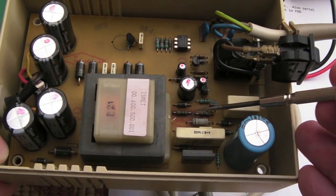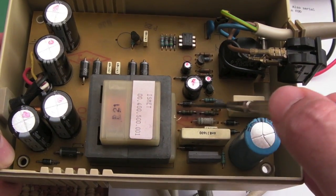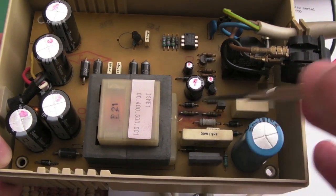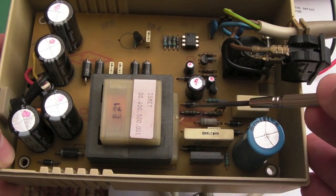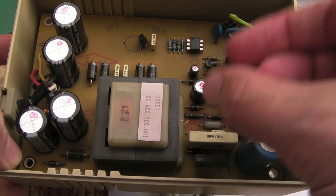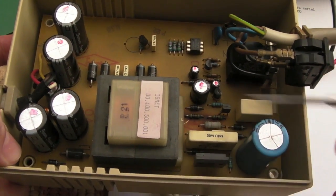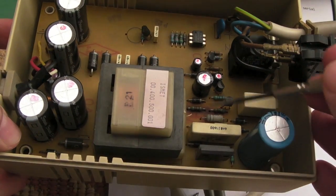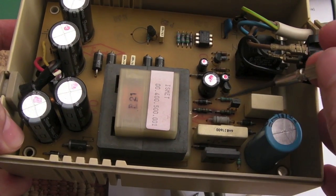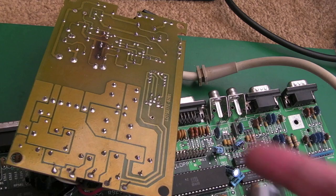A quick update on the previous power supply repair. There were one or two comments suggesting replacing those two resistors as a precaution - they've obviously heated the board up pretty significantly and that's a really good idea. Someone else pointed out why not leave extra-long legs on the new resistors so they stand off the board, and you can get a little piece of insulation tubing - or heat shrink - for the legs just to stop the component bending over. You could swap those out with new 47-ohm resistors stood off at a good height with tubing on the legs.